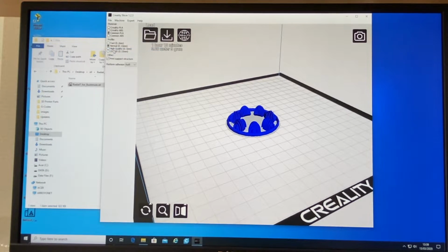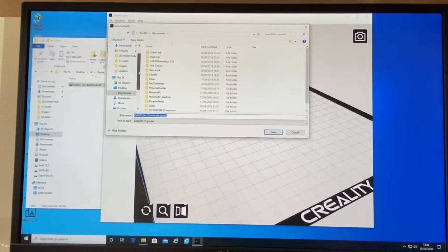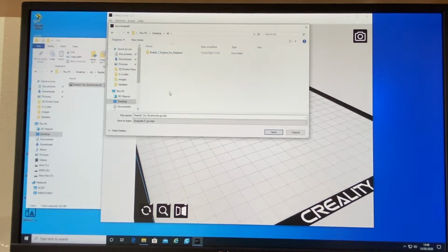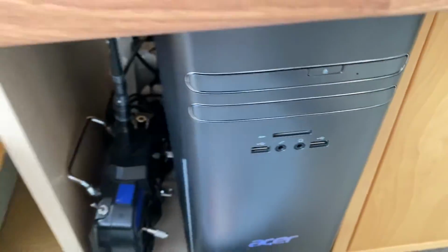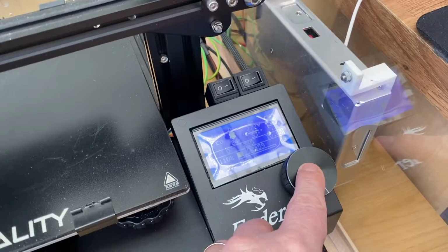Now what the slicer software does is break up that model into slices, so that each slice or layer is built up by the 3D printer. So it starts at the bottom, prints it all the way up to the top until it's completed. However, the slicer software defines all the attributes of the outside thickness walls, whether it's going to be hollow, whether it's going to have a grid in there, any little supports that are needed. So it does that automatically. It takes seconds. Complex models might take a minute or so. But it can prepare that model very, very quickly.